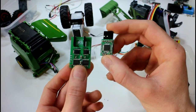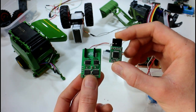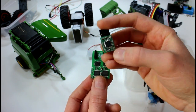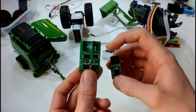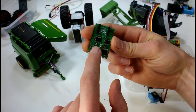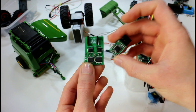Today we're going to take a look at the latest version of my tractor control board, or really any vehicle kind of control board. The way I've done it now is you have the brains of the operation — the radio module and the chip controlling everything based on Arduino code — and then a dual motor driver, actually a quad motor driver, so we have two motor driver chips on the PCB to drive four motors.